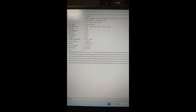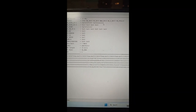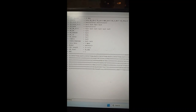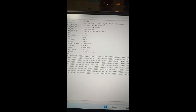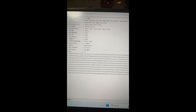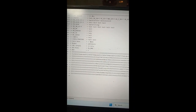If these numbers were zero here and here, that means my connection is wrong and you do not proceed further. If you get zeros, you need to make sure you did the right connections — for example, SCK in your NRF24 needs to be connected to port 13. But if you get numbers like this, that means your connections are fine.